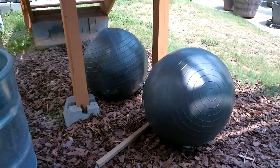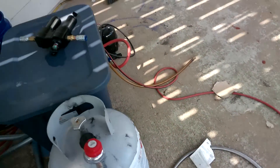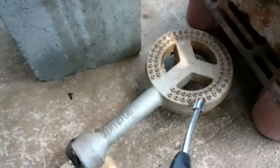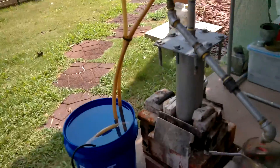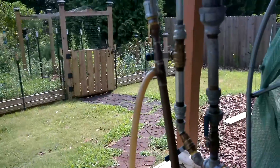I do want to say I have two yoga balls full of microwave pyrolysis gas, but this tank is pretty low, so I'm going to run this thing off propane today for an accurate run - I don't want to run out of pyrolysis gas mid-run. Anyway, we're going to run this off propane. I'll turn on the thermometer and go ahead and turn on the liebig - you don't even have to turn it on right away because this thing takes a while before stuff starts coming over. It works pretty good - this is the OG liebig from way back. Our starting temperature is 92°F / 33°C.